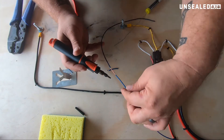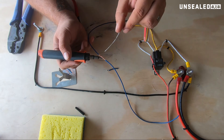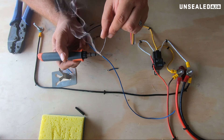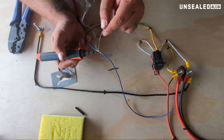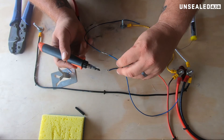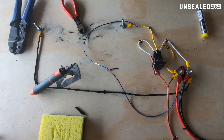Once you've done that, bring the soldering iron over to the join. Let it sit just nicely on there, and then start very, very carefully to add a little bit of solder. You'll see that solder is straight away grabbing onto that wire. Be mindful of that smoke coming off, guys — it is carcinogenic, it's not good for you. Once you've done that, take away your soldering iron. Your solder comes off first, and then you take the heat away, otherwise you'll have solder stuck to it.